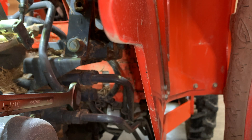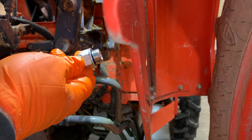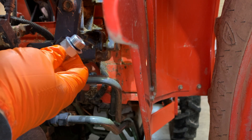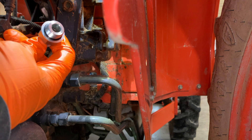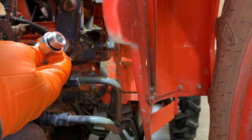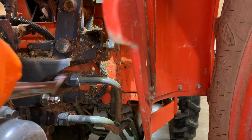I think that broke it loose. I took my straight fitting off of the hose. There's a 90-degree fitting that comes on the end of two of the hoses that came with the kit. This is the straight adapter that goes on here, so I'm going to put this on first. You can see it's got an o-ring and a little washer in there. That side is going to go toward the bow. The one that came with the kit is actually a 7/8.